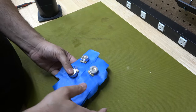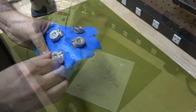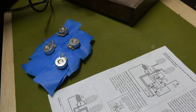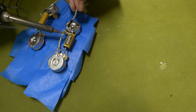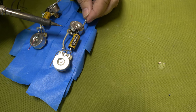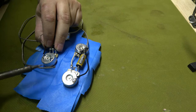Now it's time to start our soldering. Now that we've made this template, we can go ahead and add the potentiometers to it and not worry about being confined to working inside the guitar's cavity. Another great thing about this mod kit is it comes with some really good instructions from StewMac, so you can set it right next to the instructions and just one-for-one start soldering exactly where it says. Don't forget, you should wear a mask or be in a well-ventilated area if you're going to solder. If you've never soldered before, always leave a little extra wire so you can move around, in case you have to redo a part.